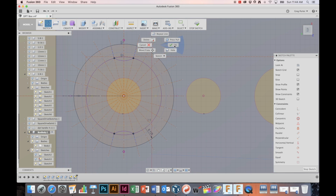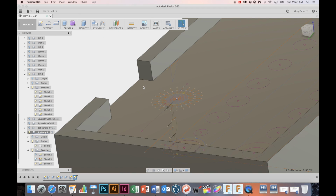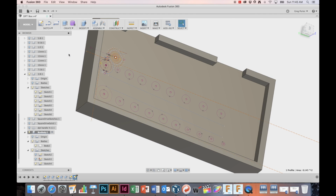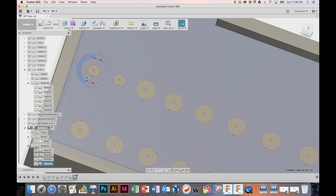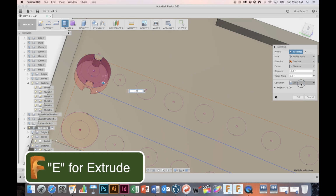So now that we've got the geometries created, we can stop the sketch, and then we'll turn off the socket geometry. Sorry for the roller coaster ride there. We'll turn off the socket geometry or sketch geometry, and then we'll select kind of 3 faces. And sometimes it's a little bit of a game to get Fusion to make the selection you want, because there's so much stuff that gets turned on when you're sketching. So you'll see that it wants to create a cut, and I change it to new body.